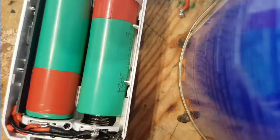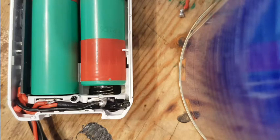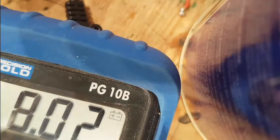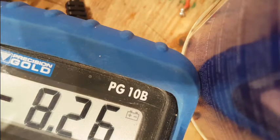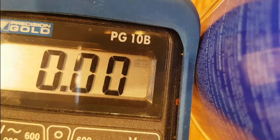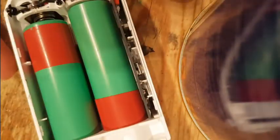So let's flip it round with the battery the wrong way — that's the wrong way round. What I should get is a negative voltage here. There's a negative there — that would be goodbye goggles. On the goggle connector I'm getting nothing — no voltage at all. And the reason for that is the diode. The diode is working, the board hasn't blown up, and the goggles are protected. That is a mod I would consider worth doing if you've got an expensive pair of goggles.